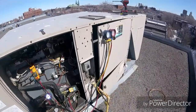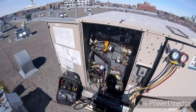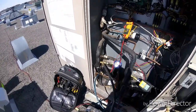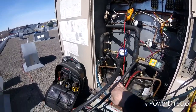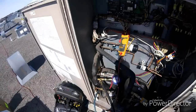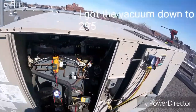Everything is welded and clipped, the top is closed, and now I'm pulling a vacuum on both circuits. I have my Schrader core remover — I put the vacuum gauge on this and I'm pulling both low-pressure sides without the Schrader cores to the vacuum pump. I have two three-eighths ports, and on the other one I put my standard gauges pulling on each side of the high side. When my micron gauge gets nicely under 500, I'll switch everything back.